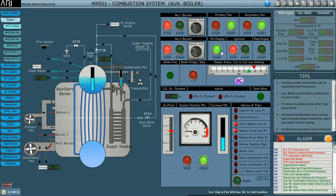Ensure the steam stop valve is in the closed condition. When you click pre-purging, you can see the furnace draft going up. Pre-purging is completed — it is done so that whatever unburned gases are left over in the furnace are driven off, preventing any chance of explosion when the pilot burner is fired. Now go for ignition. Once ignition is selected, the pilot burner fires. You can see the pilot flame is already there — when you see the pilot flame, start number one burner.